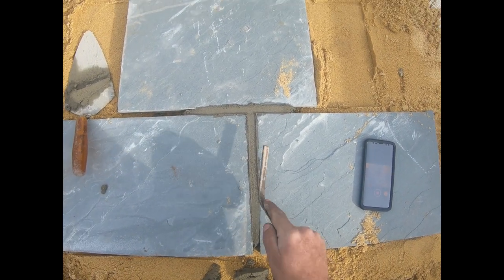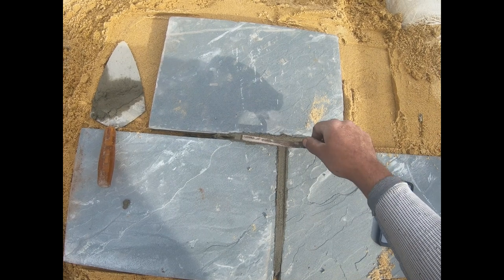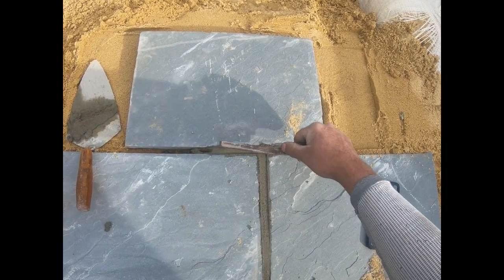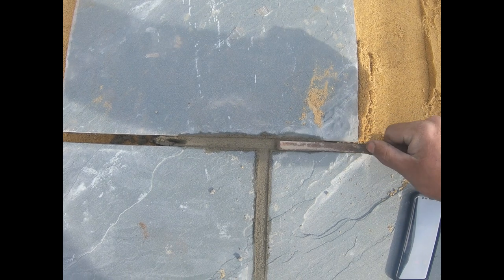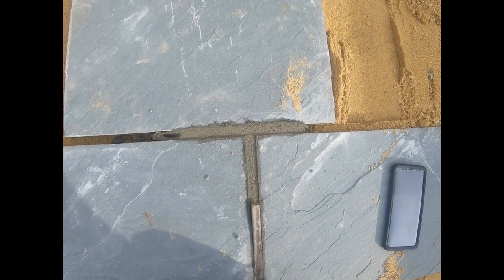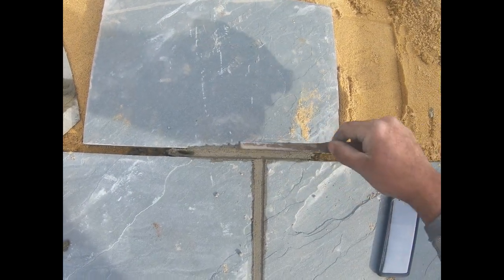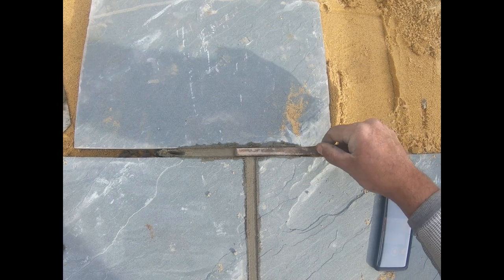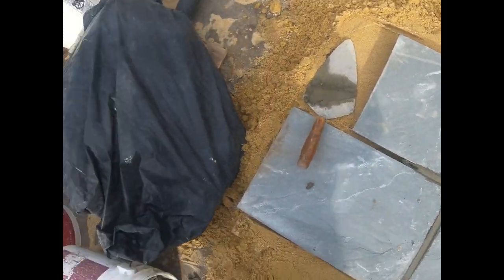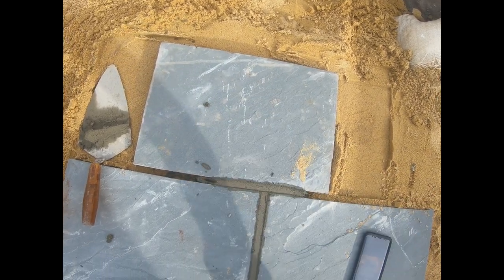All right, so you let it sit for a while. You know, this is still a little bit loose for the sake of making the video. I let it go a little tighter, but you don't want it to be so tight it doesn't finish. If you look, you can see I work it with the tool and the cream is kind of coming up. Now, I like to push it down, compact it at this stage a little bit, makes it much stronger. And I'll let it go a little bit below that edge, right? Then, just clean it up a little bit, right?